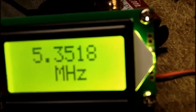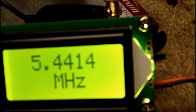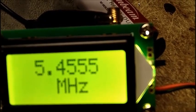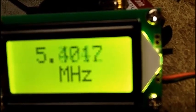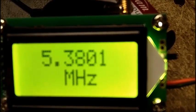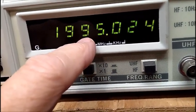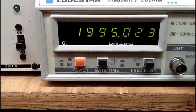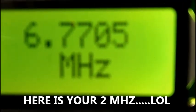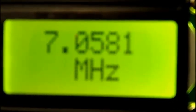Don't buy one of these things. This one might be defective. Maybe these things just don't work — I don't know. It's supposed to be good down to audio range. These auctions have very, very fine print, and it's so difficult for me to see even with a magnifying glass. On band C we're on two megacycles — 1,999.5-point-zero-zero. So two megacycles. Take a look at this: you can see there's your two megacycles, but it's reading 6.79 megacycles. These things are way off. Useless.